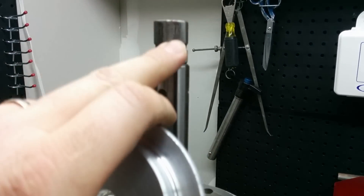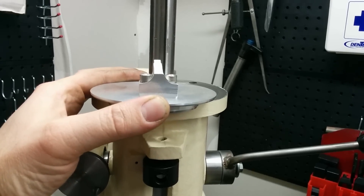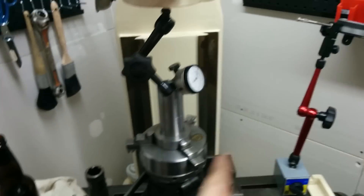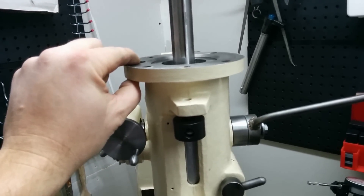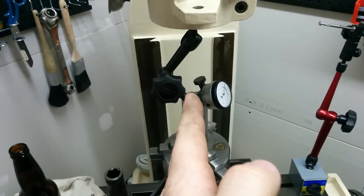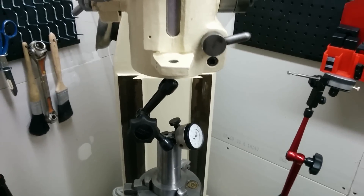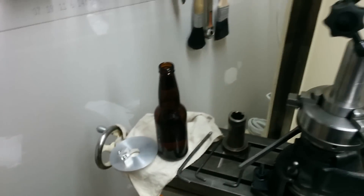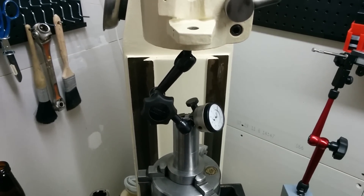The drawbar was getting in the way up there, but regardless - that disc slips down onto the spline and sits on top of the head. I'll slip it into place, put my tooling in, come off the table, and read the cutting edge of my tool, looking for the high point. As soon as I find it I'll clamp down the disc and that holds everything perfectly aligned - I'm dead nuts on the orientation. All my work will be adjusted off that. Sorry for the back and forth on the camera. I'm getting real close - hopefully cutting today - I'll come back when the next part of the setup is done.